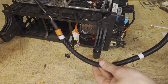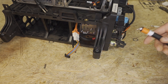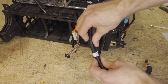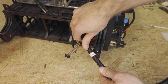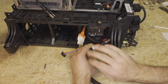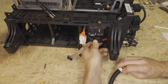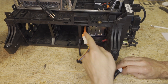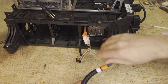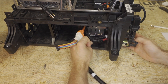Next we're going to find our HVDC negative cable, which is marked HVDC negative. On the other side it will say bay 3 negative, and in the middle it'll say 48S quantity 2 18S minus. Now we're going to take the HVDC negative cable and make sure the conduit on the bay 1 positive is not in this hole, so slide it all the way over the eyelet as shown, and then route the HVDC negative cable underneath this cable and through the hole.